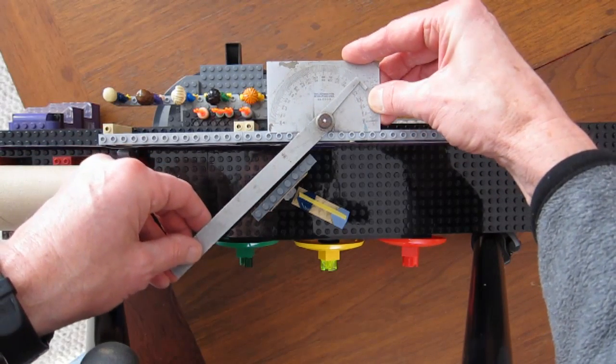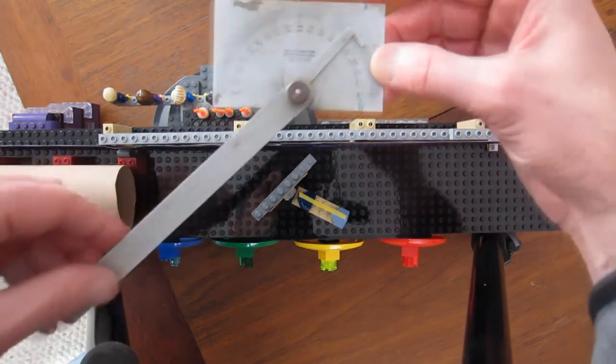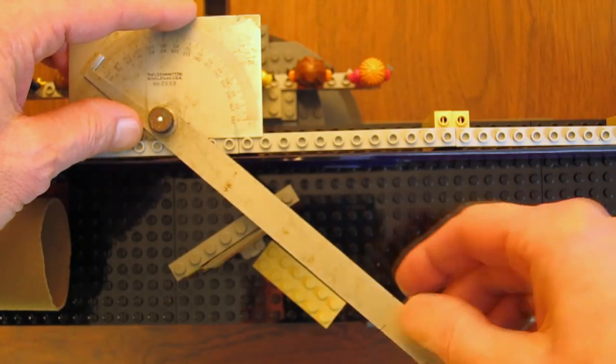So by viewing the spectrum of a compact fluorescent lamp and recording these angles for the sharpest spectral image for different distances between slit and grating, I thought I would know exactly how to build the spectrometer.